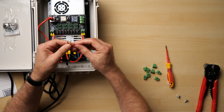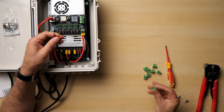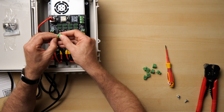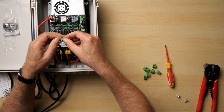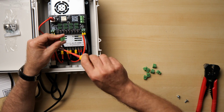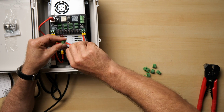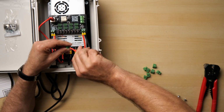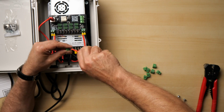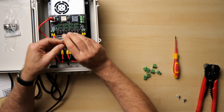So I'm just going to fold these ends over just slightly so we get a nice good connection, and then I can start putting my wires into place. There we go, and we want to get the wires right inside. I don't want any copper strands sticking out the top, ready to short out against the next connector, and so on. Now I think this is the time where I go for a bit of super speedy zoom, and we whiz through the next 5 minutes in seconds.